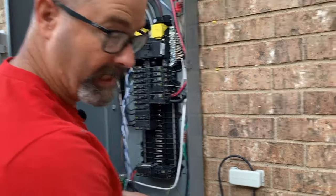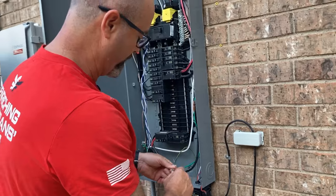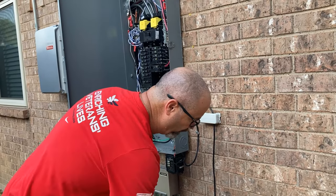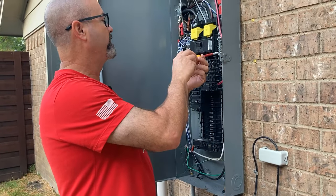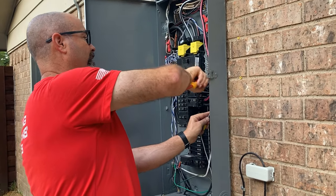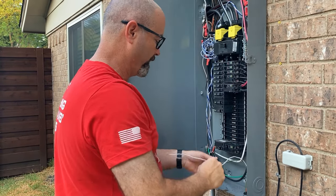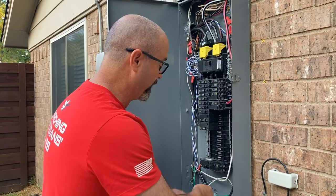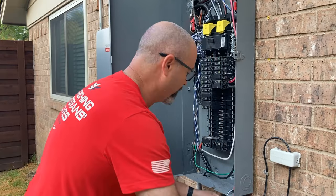I'll be super honest — see this wire? There's a splice on the ground. Of all things, I shouldn't have spliced the ground. As I'm doing this, per the FS 140 instructions, they're asking you to keep the leads as short as possible and as straight as possible. So if you're doing this yourself — or if you're one of those people who likes to hang over your electrician's shoulder — you want the FS 140 leads short, no bends if you can help it, and keep it close to where you're connecting to the breaker and the neutral bus.